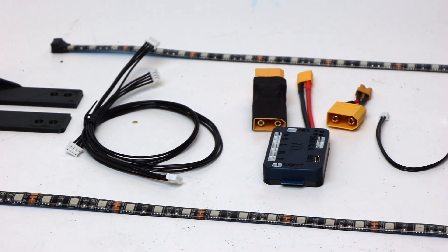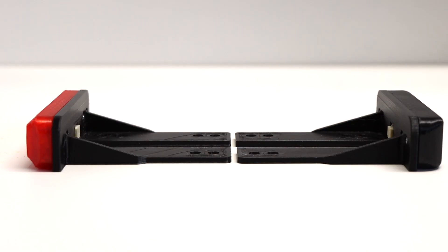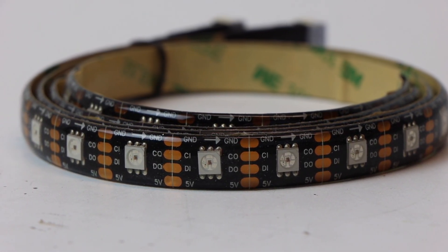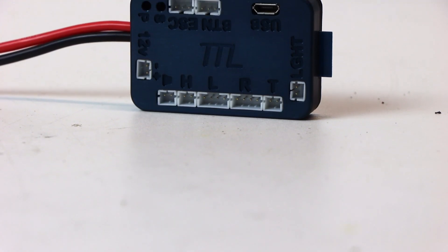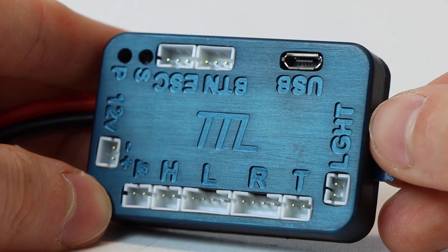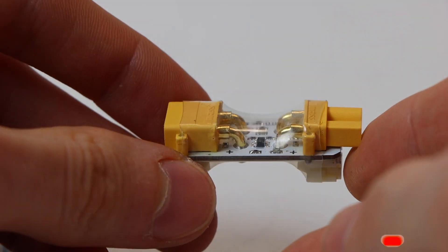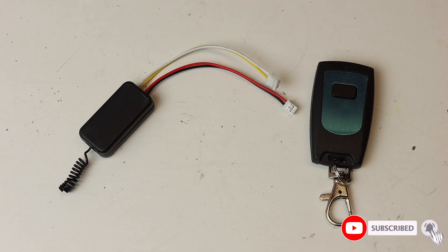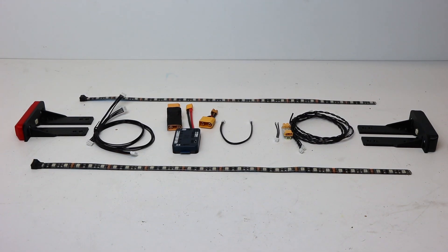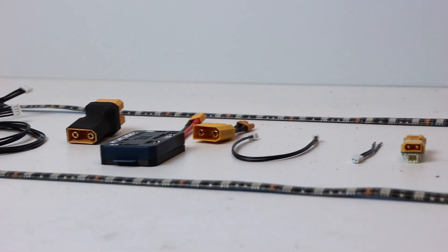For my personal TTL setup, I used both the headlight and tail light from Solid Circuits, and opted for the digital LED strips for their cooler patterns. I chose the SP control module since it doesn't require an external buck converter and is sufficient for my compact build. I'm implementing the Universal Power Switch since my build uses a Unity, and I'll also use the RF remote and the courtesy horn, as there wasn't enough room in the enclosure for the loud horn.